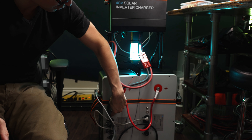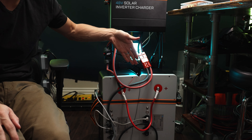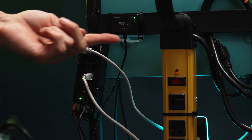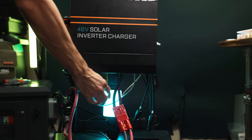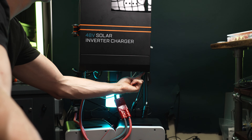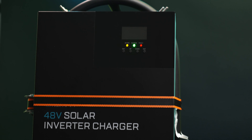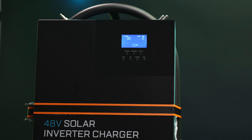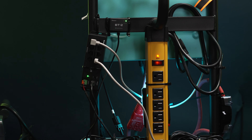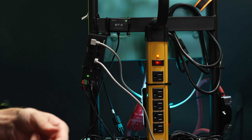Push the little button — one, three — and they both turned on. You can see our hub and Bluetooth have green lights, so they're good to go. We've got the inverter switch over here — we're going to flip that. We've got our green lights — let's turn it on. Battery's looking good, we've got our load, 120 volts, and we've got power. This is kind of messy — I'm going to do some cable management and we'll be right back.